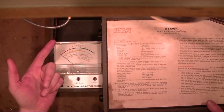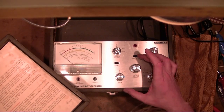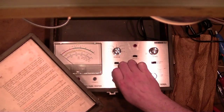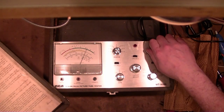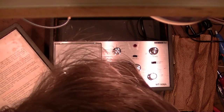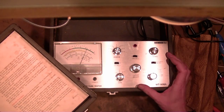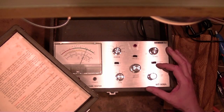Since I can't locate my tube in the tester chart, I'll pretty well guess the positions. I'll have both grids set to low — grid number one, grid number two — and we'll do black and white, with the function set to read line. The heater just says A, B, C, D, E, F, G — no numbers. So I'll go to the lowest setting and confirm it with a multimeter before I hook it up to a tube. There's also a quality and activate switch, which I'm guessing would go like this.